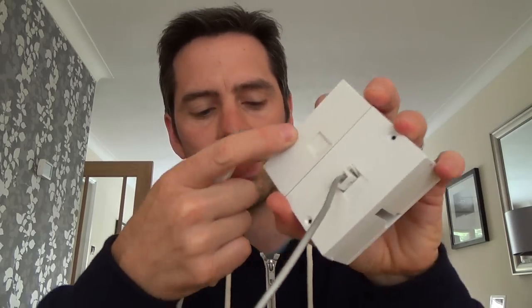They can pick up all sorts of interference because they're not twisted. The rest of the telephone network is twisted, and the cables I make use data twisted pair — telephone cable is twisted a few times per meter while data cable is twisted a few times per inch. Now if you have a look at the cable I supply, the Infinity VDSL cable — that's the RJ45, that's the big end — and as you can see it does fit in. If you slide the strain relief boot back you can see that it fits. This socket in here is an RJ45 — it might not look like it but it is — and it will fit an RJ11 or an RJ45. Slide the boot back on and it fits.